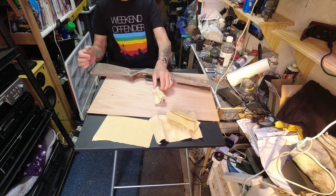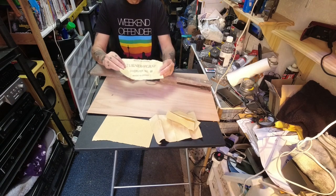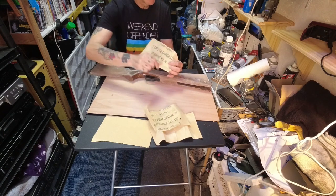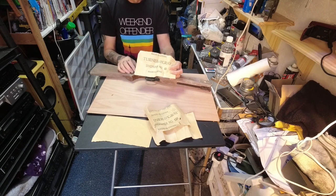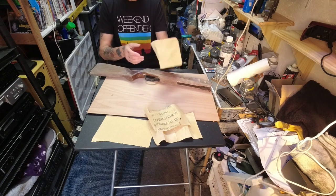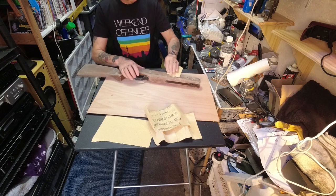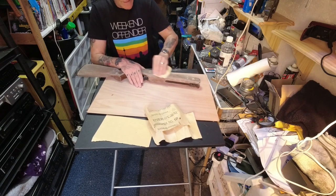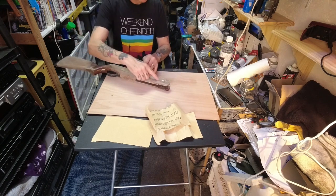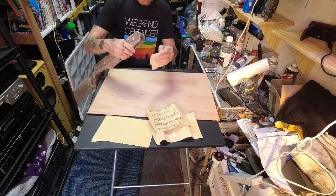I've altered my grade of sandpaper. I've gone down to 60, which is more coarse — I think I started at 120 but it was just taking forever. So I've gone down to 60, which is much more rough, and then I'll probably go to 100 when I've got it looking even and all the shiny bits off, and then continue to 100, then 200, and 400. It's slowly getting there — slowly, slowly. Some little bits took ages. There are low spots where it's still shining, and at the end it was on really, really thick. That's going to take some serious rubbing — it's almost like it's been dipped in varnish as opposed to painted.